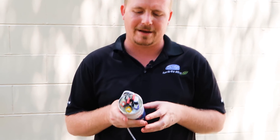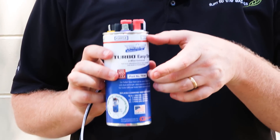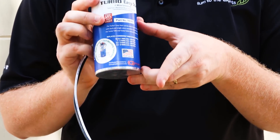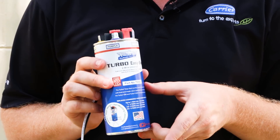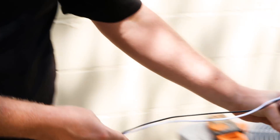If you're familiar with the Turbo 200, it's very similar technology where you have multiple taps in order to set the microfarad rating of the capacitor. Inside this capacitor, though, it has many other innovations. It has a potential relay built right in, a metalized film capacitor instead of an electrolytic capacitor which makes it much more reliable, and a nice strong magnet built right into the base.